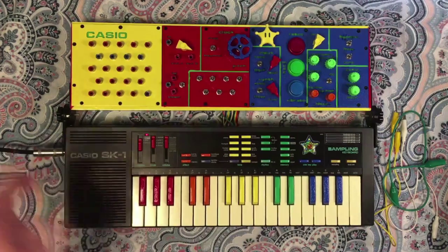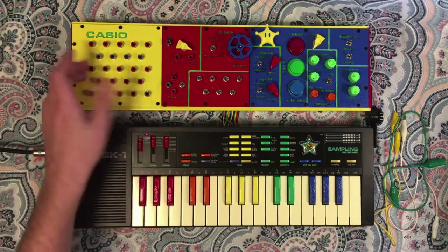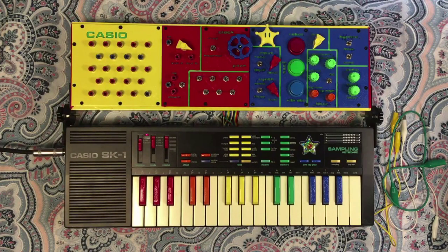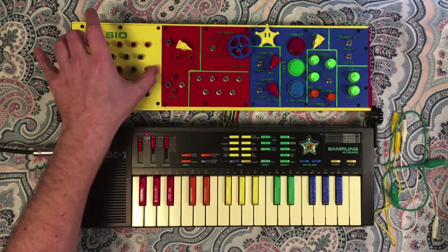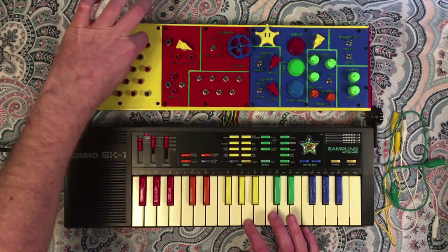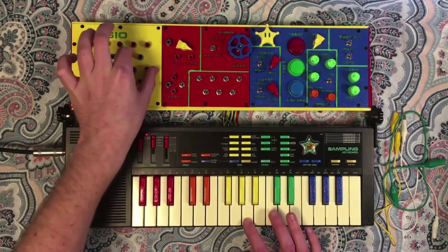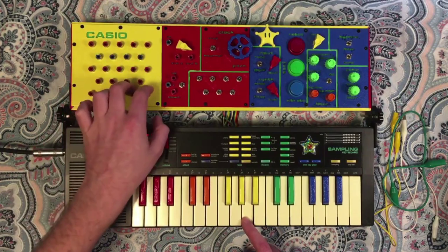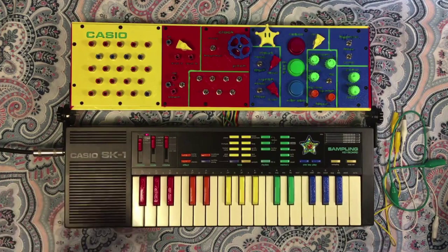It will also let you wire up multiple points and kind of adjust and balance between them. This gets particularly cool when you start using the audio signal point and the ground point. So you can kind of not completely ground something out, but kind of push it towards ground. So we'll demonstrate that here a little bit. Also, you can kind of hear it. These are wired up so that the outside is the actual connection point. That way you can kind of make a soft connection. You can hear it's not really fully connecting up the way it's going to when I start using contacts, but you can get a little bit of a effect using body contacts without necessarily needing to wire anything up.